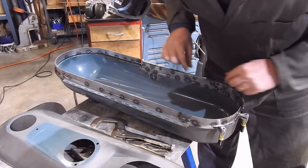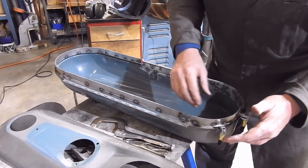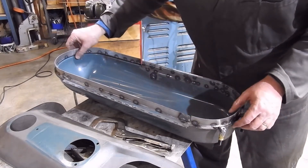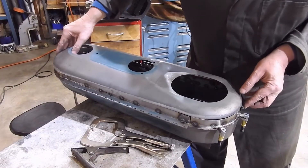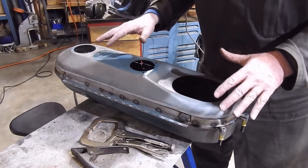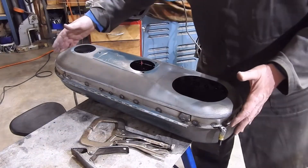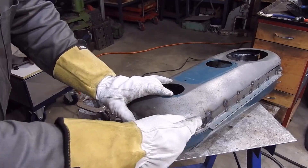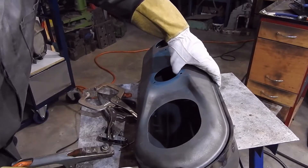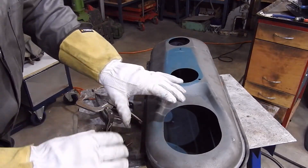Making progress - I've got this piece here tacked in place and done a little bit of finessing to smooth that out. I've got this piece secured down to the lip where it needs to go roughly with some Cleco-type clamps, so that's all sitting there and this bit goes on here. I'll tack that up, check my fitment, and then once it's all tacked sitting flat and working nicely I get to go around and weld. I'll probably use a backing bar just to make sure I don't melt through. Right now I've got really good fit-up around here but down this end I've got not so great fit-up, which means I need to move something, so as tempting as that may be I'm going to leave everything until I get this sitting right.